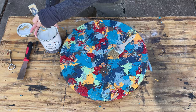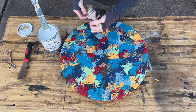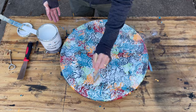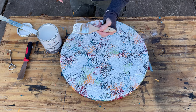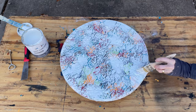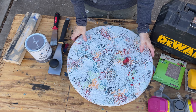I'm using an old chip brush because it's going to get into this rough textured surface. Put the white everywhere and push it into the crevices — don't be afraid — because we're going to be sanding this off. You can go in all directions; in fact it's better to go all directions. Make sure you go around the sides, get the top tip and the bottom tip, and make sure there's not a lot of dripping. Then wait for that to dry.